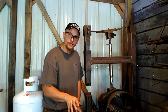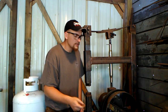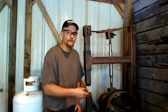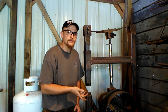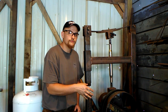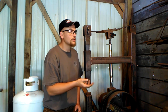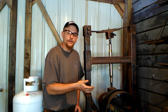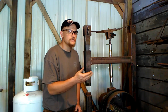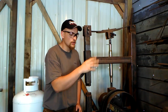Keep that in mind when purchasing a power hammer. Don't get all hyped up thinking you need the largest hammer in the world, because a lot of you don't. Maybe you have an S-hook business and just need to draw out tapers on nothing more than three-eighths-inch rod. My revisited DaVinci cam hammer design will work for you perfectly and flawlessly every day. But if you're trying to move one-inch billets of steel or larger, that's not going to be your hammer. Its design purpose came out of necessity to do production work on hooks, and it worked perfectly for that.